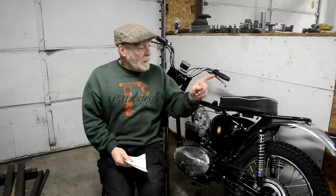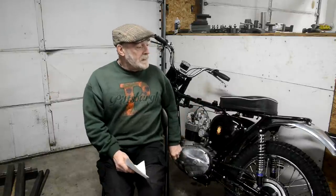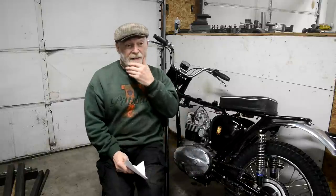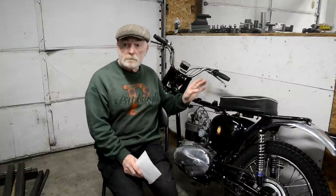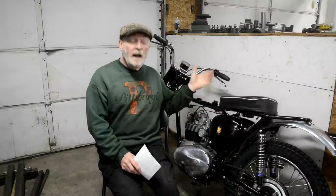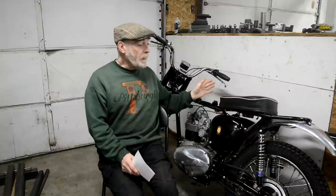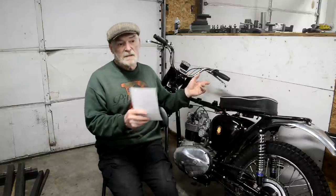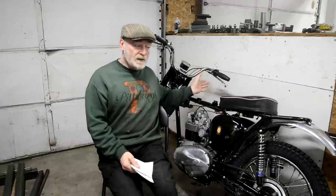I've sent an email off to Electrics World to ask them about this. They in particular asked about the wattage of the bulbs. They did think it seemed a little bad that I couldn't get the horn and the lights to work. But actually, what I've done is I took that halogen bulb out and I rummaged around, found a proper Lucas reflector and an ordinary bulb. And with that, the lights are better, front and back come on, even just a tick over. But the horn doesn't work a tick over, but okay, that's sort of academic because if you're a tick over, you're standing still. With just a few revs, I get much better lights and the horn will work while the lights are on.